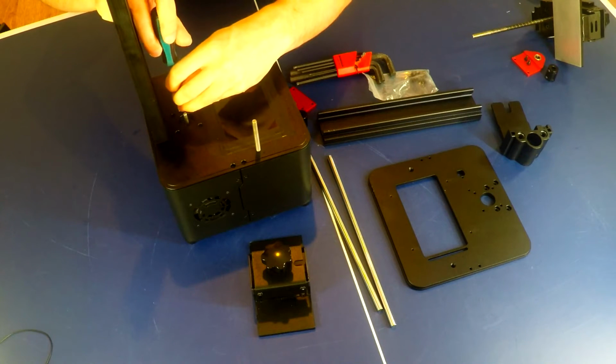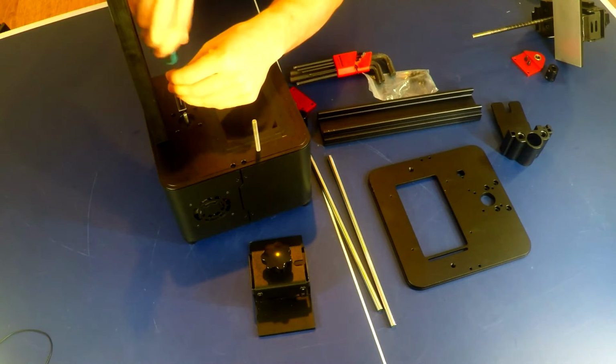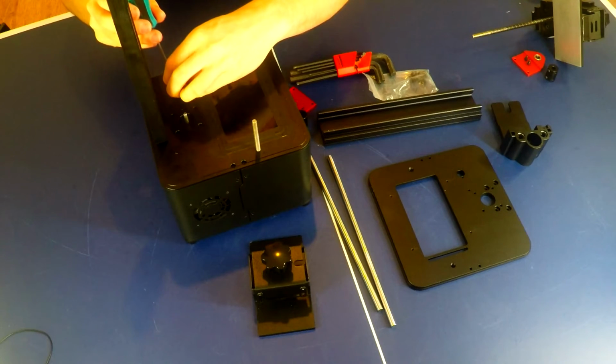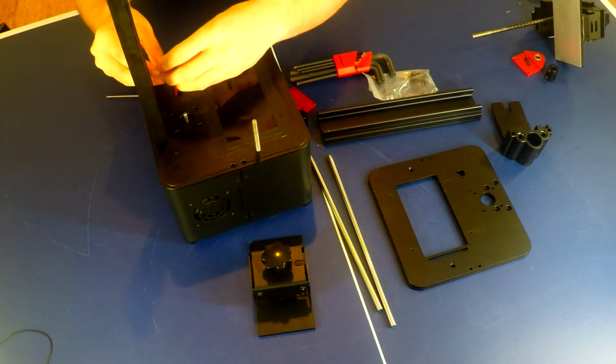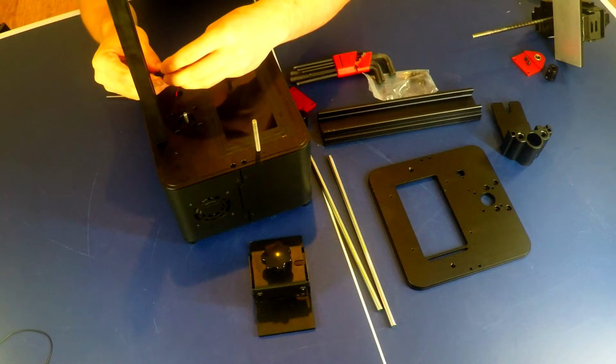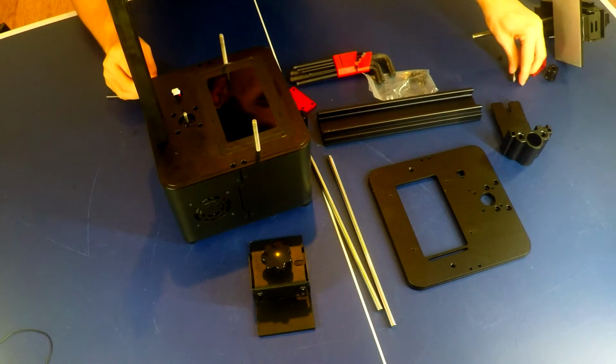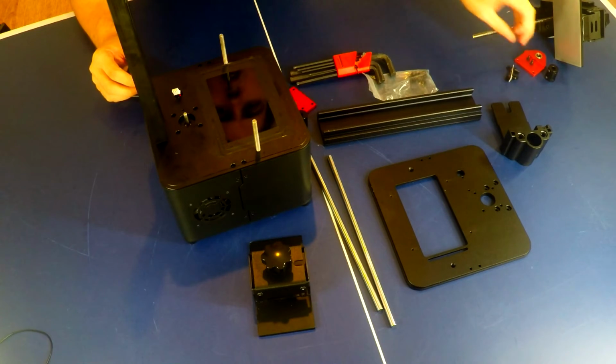Next we turn our attention to the optical sensor that triggers the home point for the Z-axis. It's got two bolts. Undo them, and then once you do, you'll see a plug underneath that you need to very carefully undo. There are two black washers which space it off the platform, so make sure you don't lose those. You can see one tried to roll away for me.